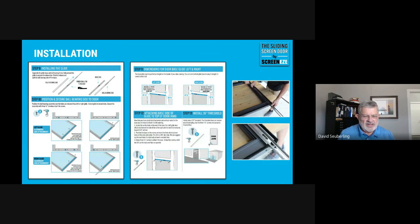Now we have a completely assembled door — the cap is on, the slipstick is screwed in, all corner keys are tight, and everything checks true diagonally. There are three categories: building the door, attaching the door to your structure, then installing the remaining hardware to operate it. In step nine, you separate the glide base from the glide with a small black clip. At that point you determine left or right, inside or outside. The door header is completely pre-drilled for both glide-right and glide-left configurations.